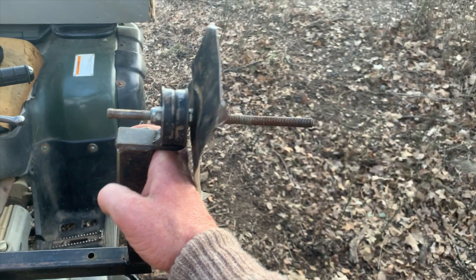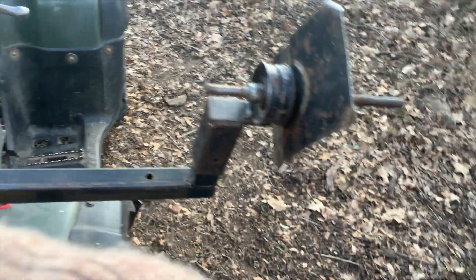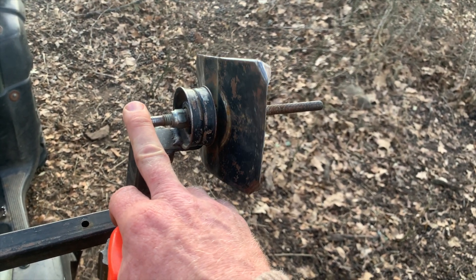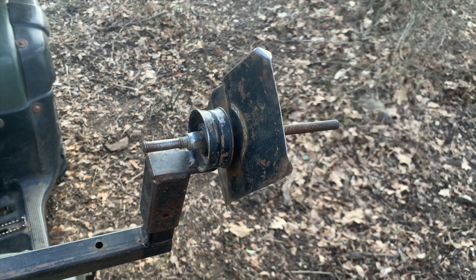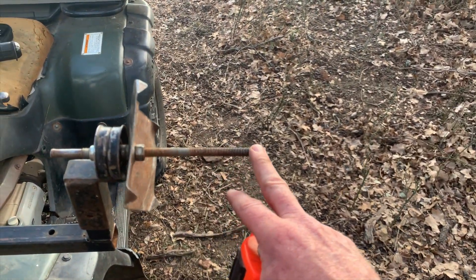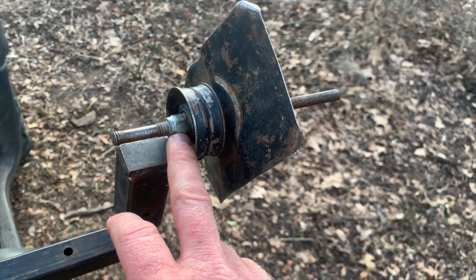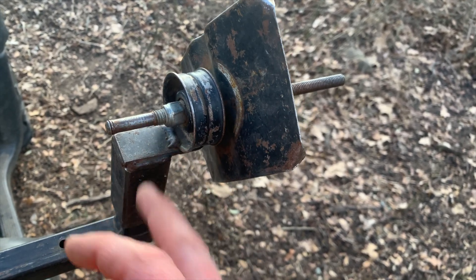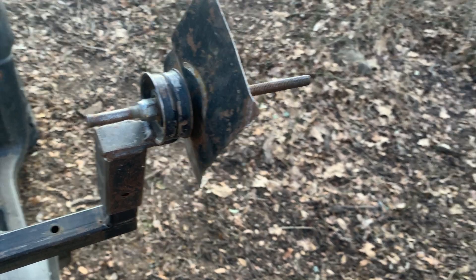For the rolling-up part, we've got more one-and-a-quarter inch tubing sliding on there, another little piece of plate, and a bearing on here. This bearing accepts a three-eighths inch all-thread running through it - the size of the bearing isn't so important, as long as you're running three-eighths inch all-thread through it. You can see where it's worn out from my drill biting onto it. This piece of all-thread is seven and a half inches long. This nut right here is a locking nut - it's got a nylon strip inside. Go to the hardware store and you'll know what I'm talking about.